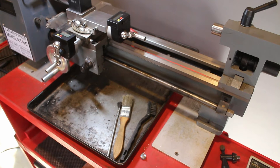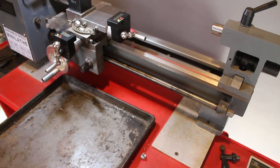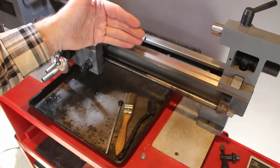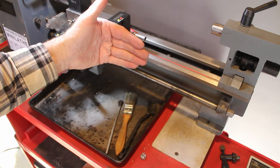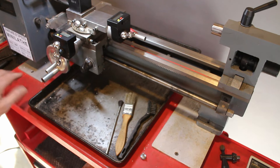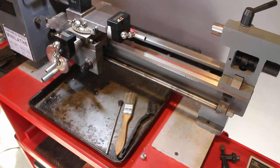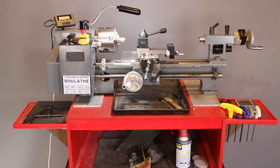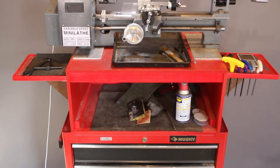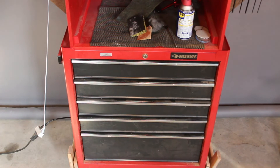Another improvement — I got the idea from another YouTuber — is to use a baking tray as a chip catcher. You can just take this out and dump it whenever you want to. I removed the underneath plate and the back plate that was there as the backsplash catcher, and I've mounted it to these large aluminum plates here to stabilize it so that the bed can't twist from one end to the other. It's mounted to a riser on my rolling tool cart. I have the whole machine mounted to the top of a rolling tool chest with a box I built out of half-inch MDF and three-quarter-inch MDF at the top and bottom. In my drawers down here I keep all of the parts I need for the machine.